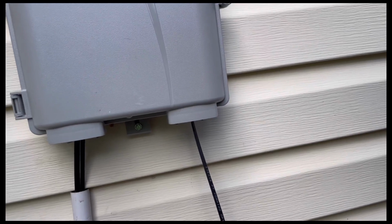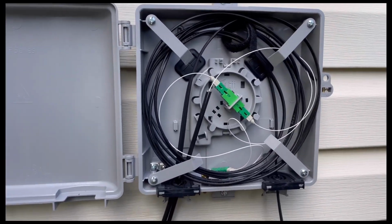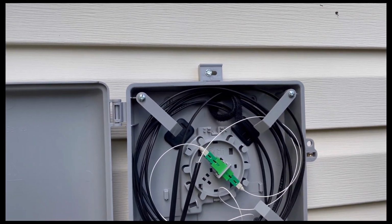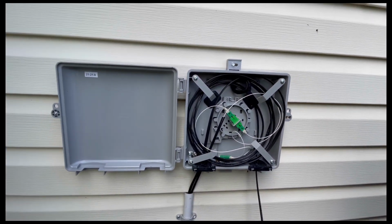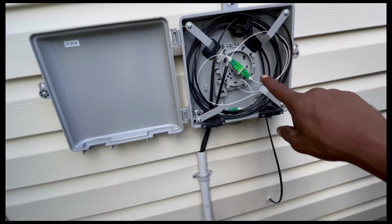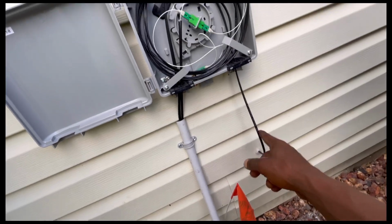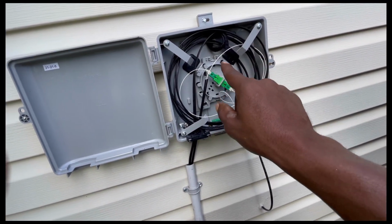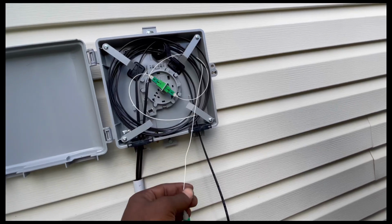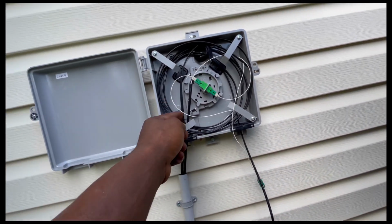So to figure out if the old line is still giving some type of service, we're gonna go through the diagnostics, that's what I would like to call it, to actually see if it's still connected. So only one line is gonna be connected, giving service. And I'm about to bet that it's the one that the tech just installed, which is the temporary line. All right, so this is the line that's connected, that's going back into the home right here and giving the service. And this is one of the lines going up, connected, and it's spliced in right here together to give the services. So I already seen it. This is the old line right here, splice in piece. So I narrowed it down. This is the new line here.